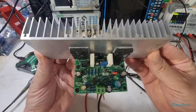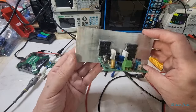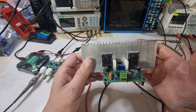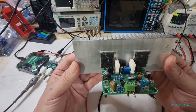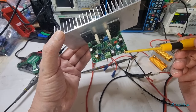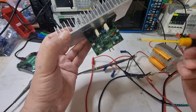So this is the kit actually built up and put onto a heat sink. Remember you can put isolators behind the transistors — they come with rubber ones in the kit, or you can use wafer-thin mica, which is what I tend to use. I bought a big pack of them at one stage because it was so cheap, so I figure I should use them.